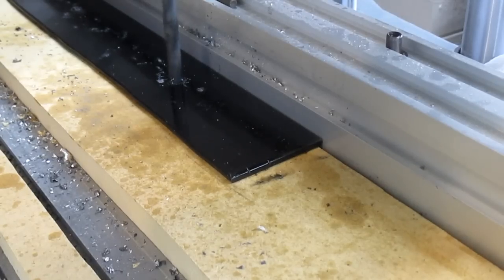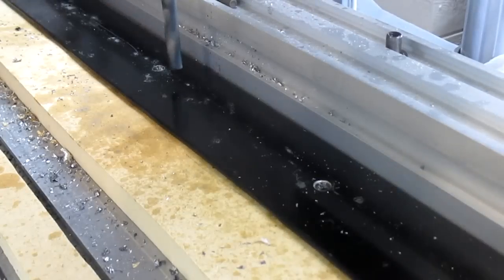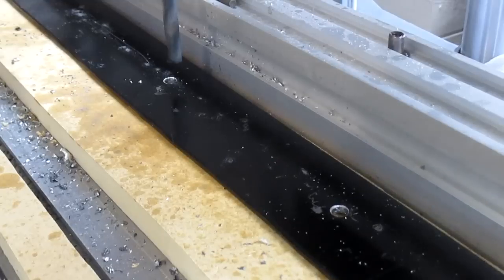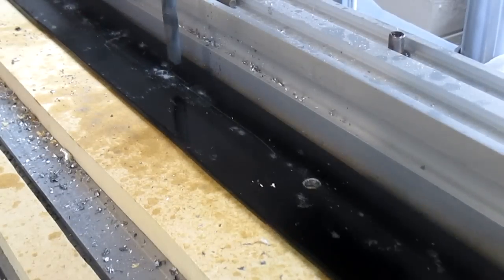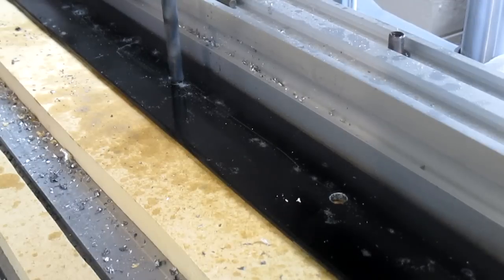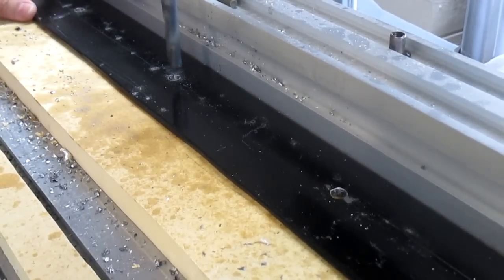After drilling the steel, I used a much larger half-inch bit to drill a slight countersink, which worked to deburr the steel. I could have used a hand file, but this was quicker. Since the tolerances between the maker slides are so small, you don't want to cause potential problems by having a small piece of metal sticking out between them.